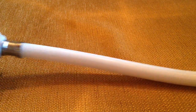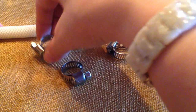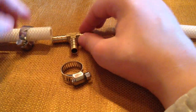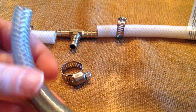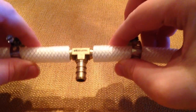The last cut we're going to make is on the toilet connector — cut it about halfway, right in half. After you've sliced the toilet connector in half, slide the little screw clamps onto each side. Then push the crimp tee into the hose on both sides — it will require a little strength to get them all the way on. Then take the smaller hose piece you cut from the sprayer, insert the screw clamp, and push that in as well.